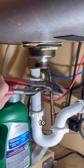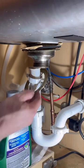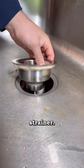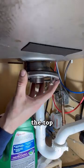Just a side note: never be nice to anything that you're taking apart. With the old one out, we're going to clean the bottom and the top and drop in our strainer. I'm using plumber's putty underneath the top of the strainer.